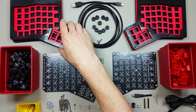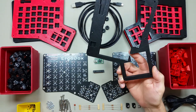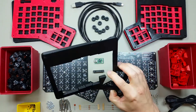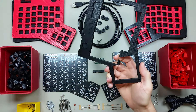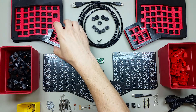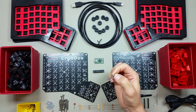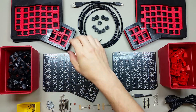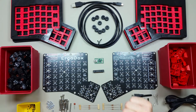This is the case I chose to use for the ErgoDox. I downloaded the Lexan case design and I modified it. You can download my modified version from my website — look for the link in the description of this video. I printed this with a RepRap Prusa i2 with an 8-inch PCB heat bed. These are 3mm holes, and I'm using M3 25mm bolts and M3 nuts to sandwich these case components together.